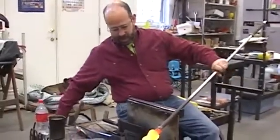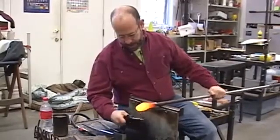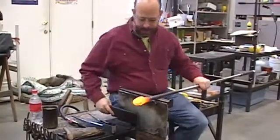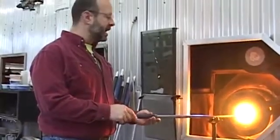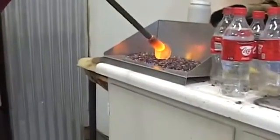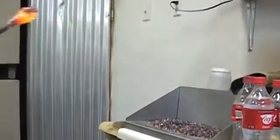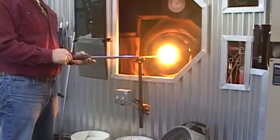I've just taken my first gather of glass and I'm just going to shape it a little bit. Now I'm going to reheat it so the edges will be nice and hot and I'll be able to roll up those little chips. Little chips are very densely colored glass made specifically for glass blowers to decorate and color their pieces. I've flattened the shape of the glass so I just collect two stripes of all these chips. I'm now going to heat them up and melt them in, then smooth it down into the surface and begin the twisting process.